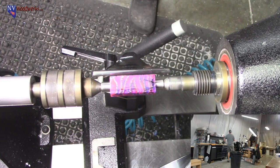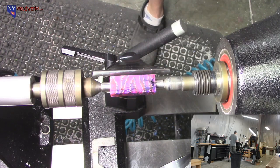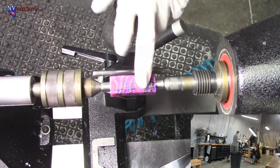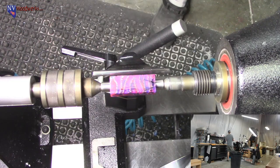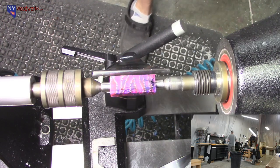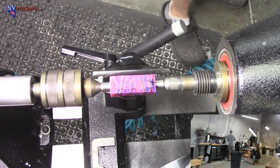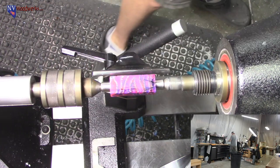One thing that I don't think is that it shrinks. Alumilite has a really, really low shrinkage factor. But one thing I've thought of, and possibly you could use this to your advantage, is that if you pulled them out of the pressure pot, cut them up and then drilled the hole for pen blanks, it might actually shrink a little bit. That may be good in some cases, I don't know, but I'd rather have the thing totally stable, totally finished up, so that when I turn it, everything's going to go the way I think. But I think you're fine if you just wait a day or two.